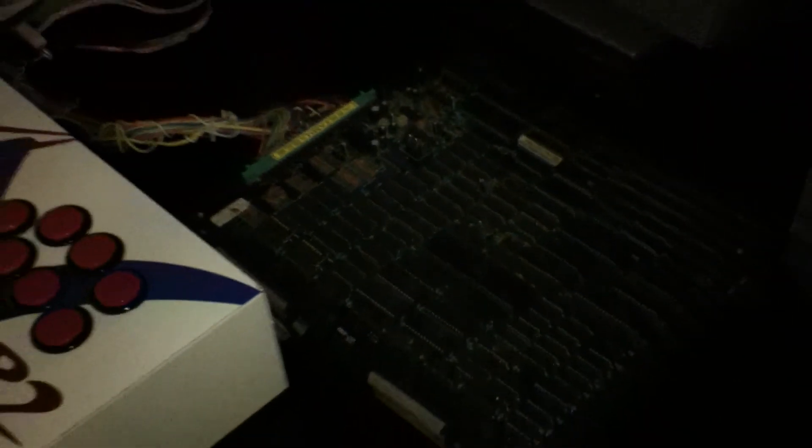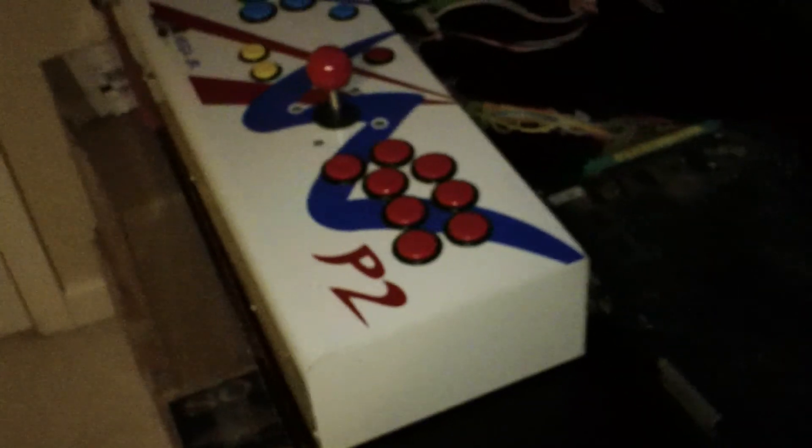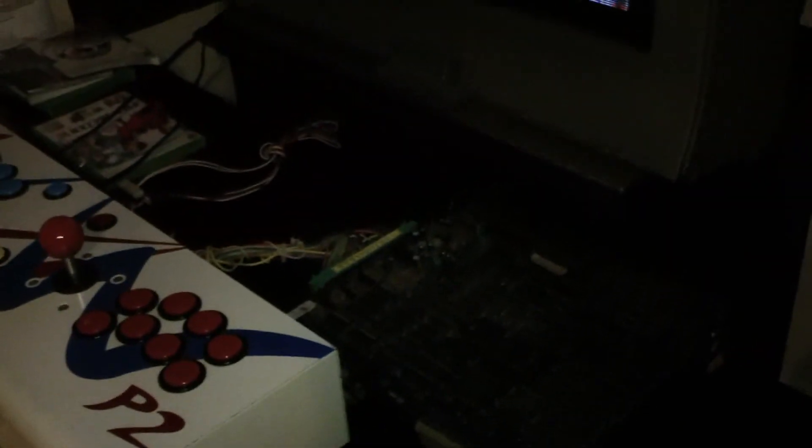So I'm wondering if there's an issue here with maybe a decoupling issue with some of these caps. I'm not exactly sure what they are on this one — I'll have to check out the board a little bit more closely, clean it up, and clean up the edge connector as well. I'm thinking it's probably some noise on the 12-volt rail from the supergun's PSU, and I'll test it on my other cabs and supergun to see if I'm getting any different results.